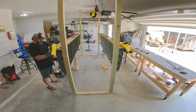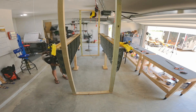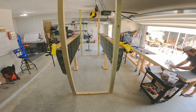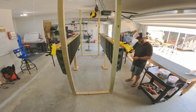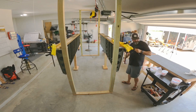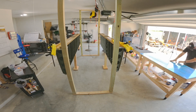You'll see me going back and forth here to figure it out. When you first grab that doubler off the shelf it looks completely symmetrical, but it's not — on one end, fore or aft, there's a little jog in the hole pattern. So if you're doing this and you think the hole pattern is screwed up on your doubler, it's not screwed up. Flip it over at the rear spar — there's a little jog in the hole pattern along the spar. Just flip it over and everything lines up.